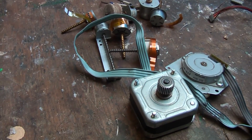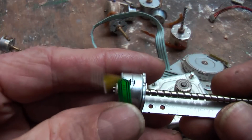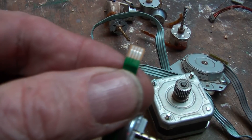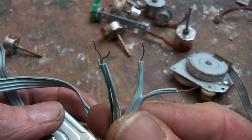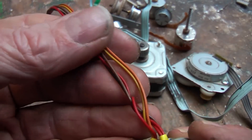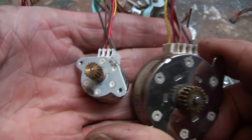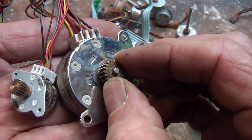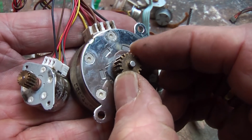The next kind that are most normal or common are the four-wired ones, like this one from a floppy drive with its base, or the floppy drive with a ribbon wiring with four wires in that. This one here is from a printer and it also has four wires. This one here actually has five wires, and these two here have six wires. But no matter how many wires, you can still tell because it sort of judders and goes in very little steps and doesn't spin freely - there is a little bit of resistance there.